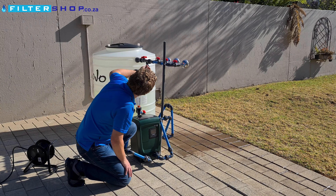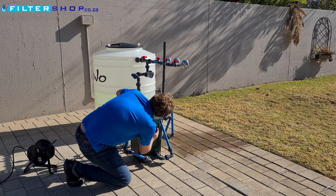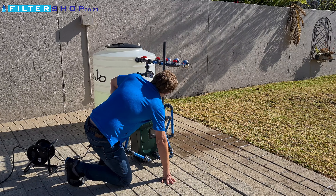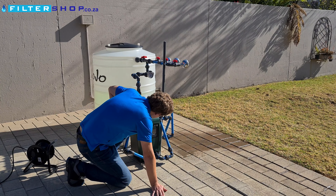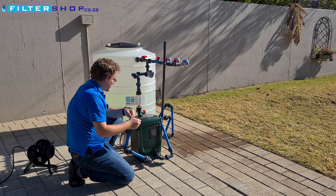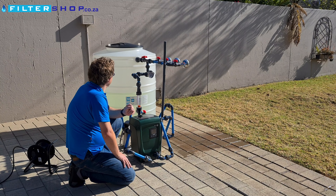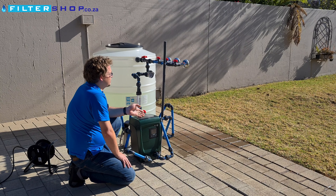Okay, where we're setting it now looks like about 3.5 bar. On the screen here it says it's set to 3 bar. It's actually running — it's incredibly quiet. Looks like it's overshot a bit; we're reading 3.4 bar there, but on the display it says it's doing 3 bar. What's really nice is you can see the power consumption and the flow rate as you go. Let's start on its default setting and see how it does.